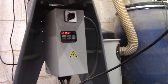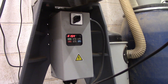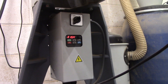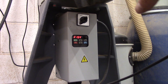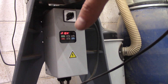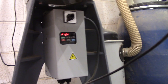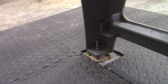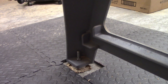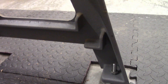Underneath the lathe you can see the inverter. This inverter is bolted in position underneath on the backside of the legs, but you can take this off and position it somewhere else — it's got a long cable, you could have that bolted to the wall or onto a board anywhere else. The feet that come with the lathe are fully adjustable so you can wind them in and out to get them to the right height for the floor that the lathe is going to sit on.